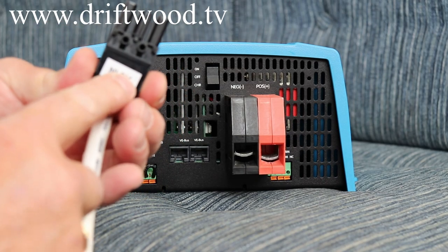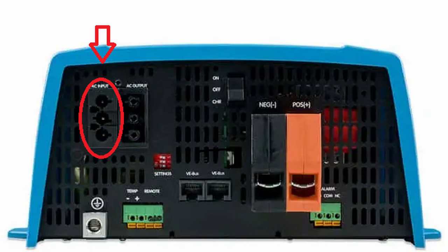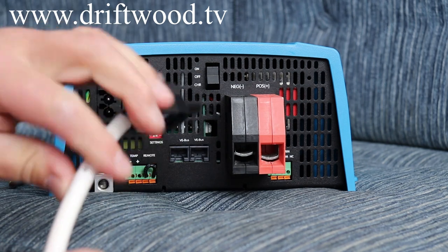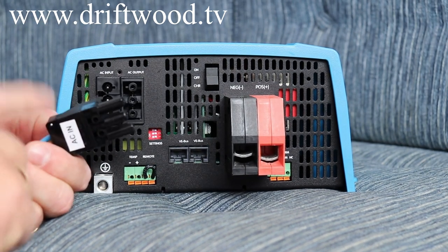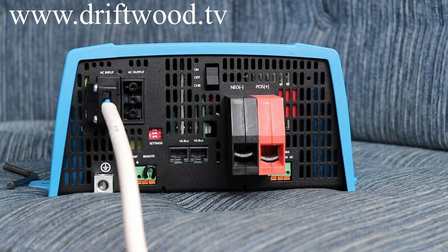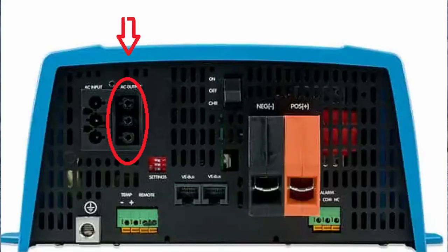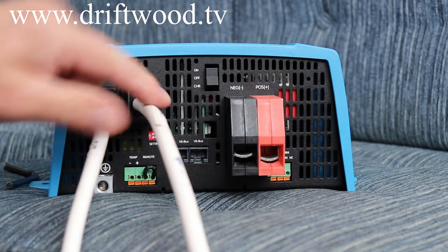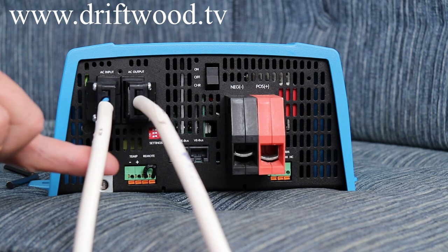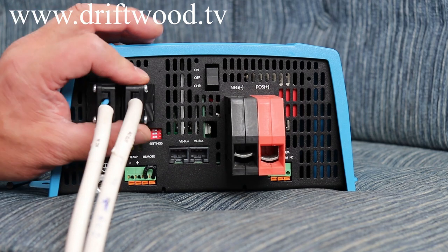When you set up your cables, your AC in will go into this plug here — this is a male plug — and that male plug goes into the port marked AC in. If you try to put it into the other socket it simply won't go. The important thing is to make sure that you label these correctly and have your wires correct. We also have a second plug labeled AC out, which goes into the port labeled AC output. That cable travels down to the RCD, while the AC in cable is coming from the outside shore power via the galvanic isolator.